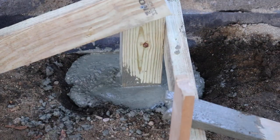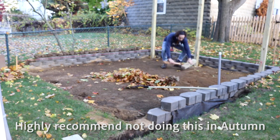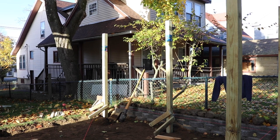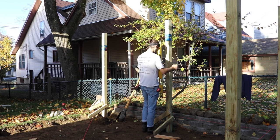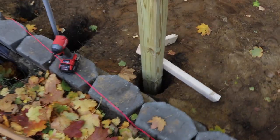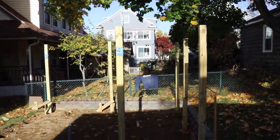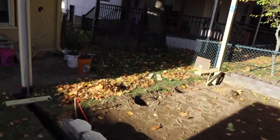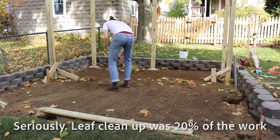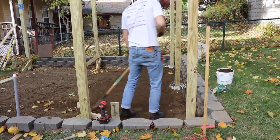Concrete's fun — chemical reactions and stuff. So another clip of me just cleaning up leaves. It took a lot of time to clean up all the leaves because this was properly when fall started. I cleaned it up, tamped it down, got it level because I was about to put down some paver sand. Making sure it's nice and centered in the hole — it looks good, it looks square. We're doing four posts in the front, three in the back. You don't want leaves in your concrete and you don't want leaves underneath your paver sand or anywhere in your workspace.